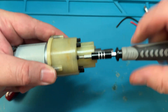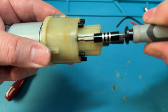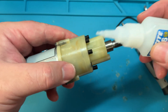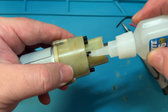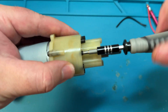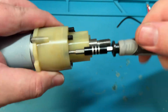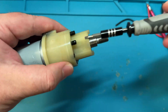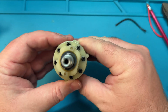The next step is to lock the clutch by screwing the grub screws into each of the tapped holes. I've started a grub screw in all eight holes, then I'm putting a drop or two of Loctite on each of the threads before screwing them into place. You'll feel when the grub screw bottoms out as it comes into contact with the ring gear. Once that happens, back them off about a quarter to half a turn on each one. You can adjust the tension so there is no play at all in the shaft, which helps in robotics as the delay between stop and start is reduced slightly. For lightweight applications two or four grub screws may be enough, but for combat robots or heavy-weight applications, for the price of a few extra grub screws it's worth going with eight.